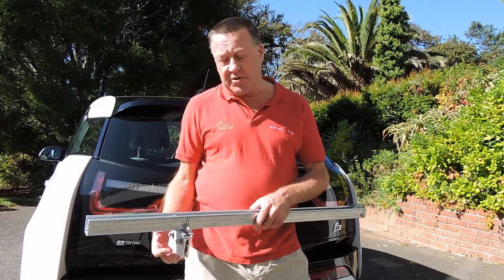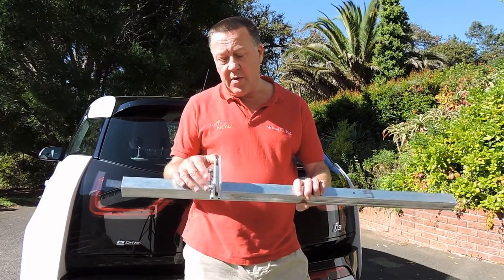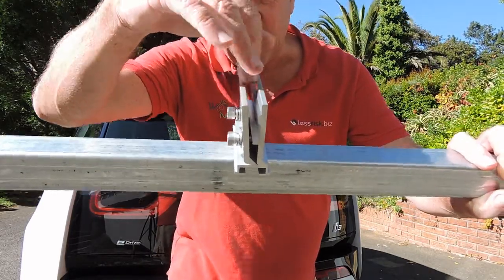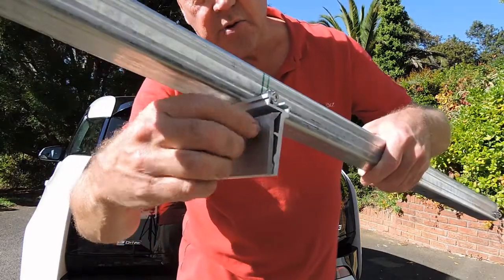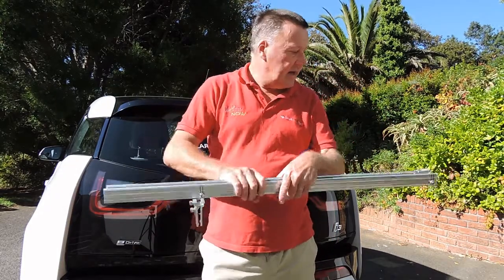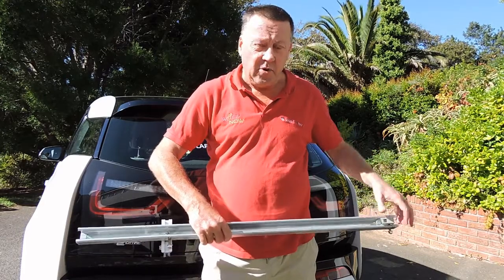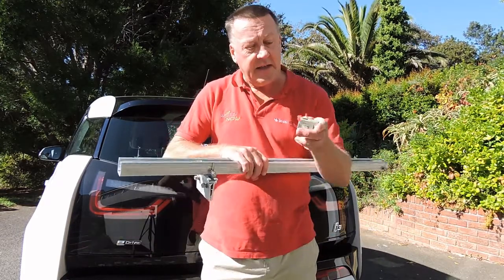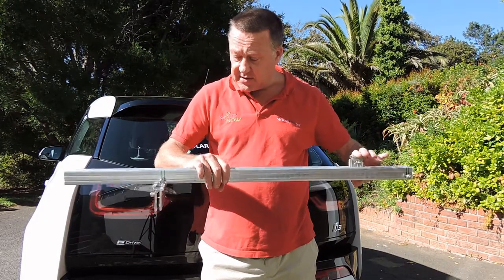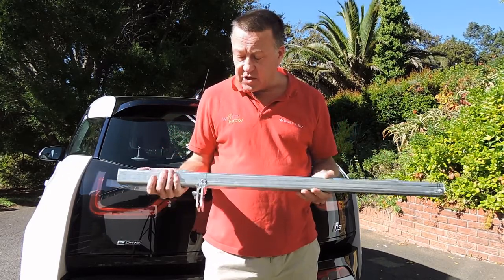It's a clip-lock metal roof structure, so it requires these special mounting brackets. The roof structure actually tucks into the edge of this aluminium bracket and then it's screwed in place to retain it firmly on the roof. This unistrut structure has clamps that go onto — for those of you not familiar with unistrut — these clip onto the inside of the aluminium solar panels and then push down onto the plates onto the unistrut, and they lock into place providing a pretty rigid, secure mounting.